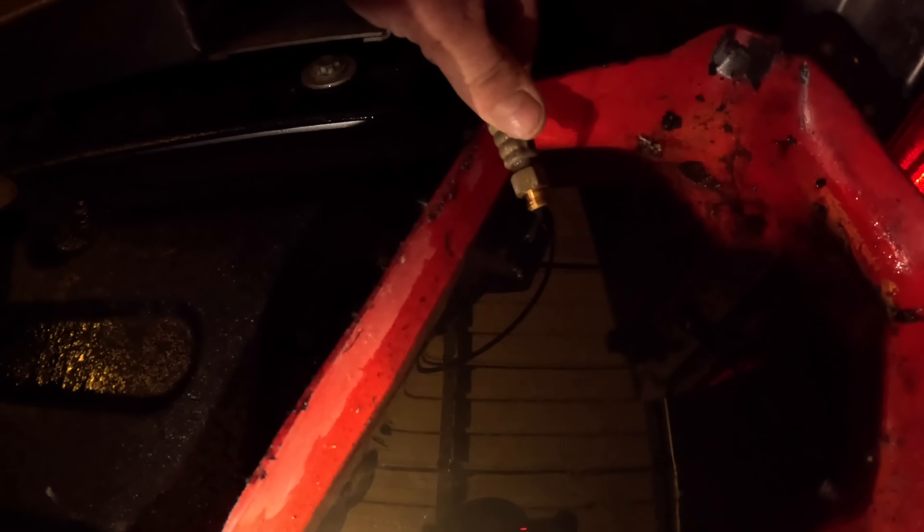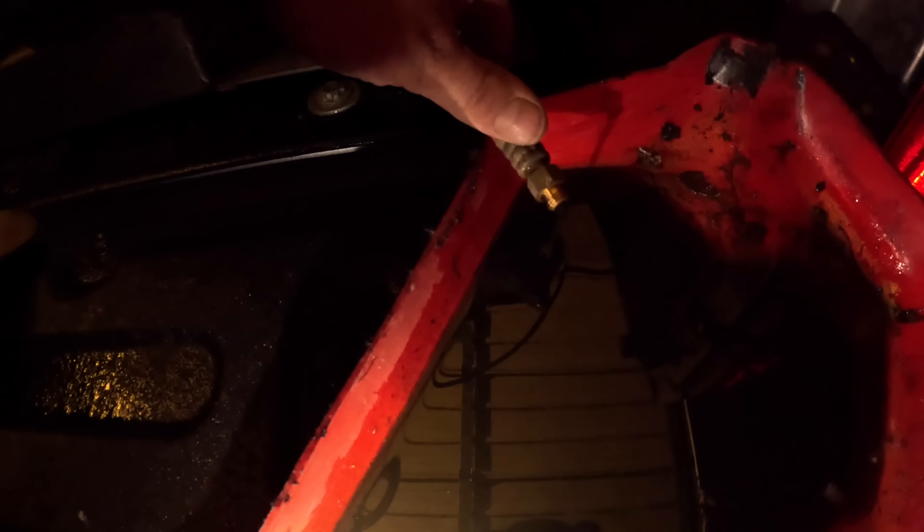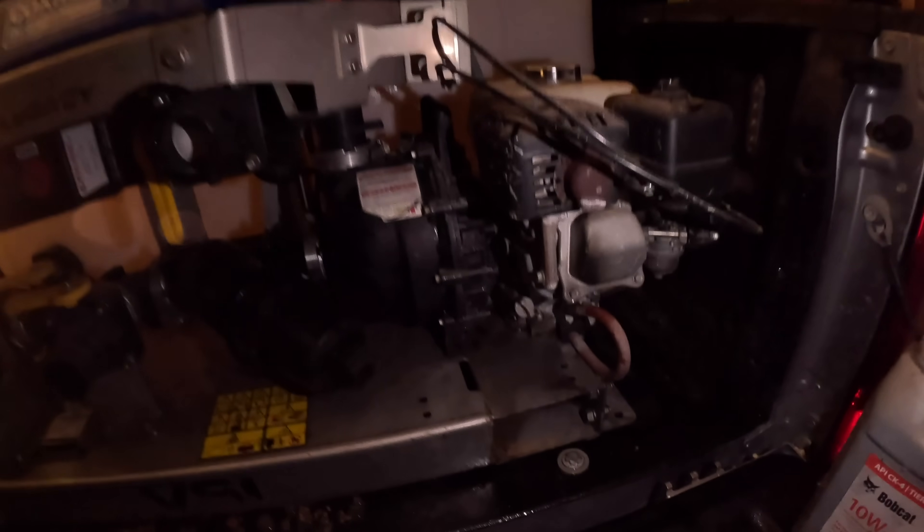I was hoping for an easy night but that's never how it goes. I went to go check everything and — hard to see in the video — but there is gas in this oil. So this unit must not have gotten pumped all the way out, or the fuel wasn't turned off and it ran empty. It's hard to tell on camera but it's pretty watery and has a very gas-like smell to it. All right, got the world's fastest oil change done — sounds a lot better.